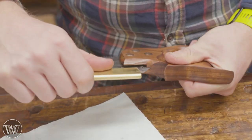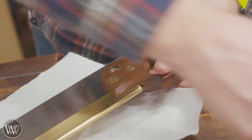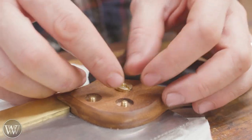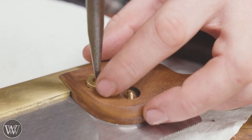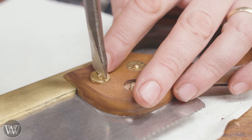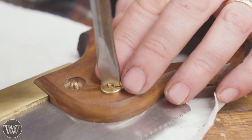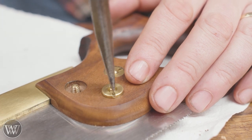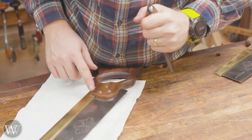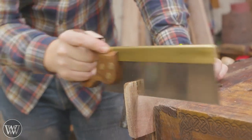Before the final little details, it's time to put it back together so I can see how it looks. You fit it down in place until the nuts pop in, then get the split nuts on. I actually put the split nuts on the face side — historically they're on the back, but I like showing them off, so I put them on the side with the etch. There's no right or wrong to that. Clocking the nuts so all the lines run in the same direction is something I like to do. Be careful with how much force you put in — good chance to pop them out. Let's take it for a test drive and make sure it still cuts. I didn't do anything to the blade so it should cut just as well as before.